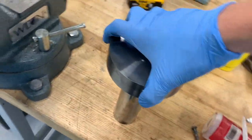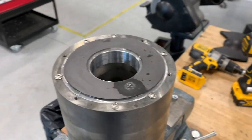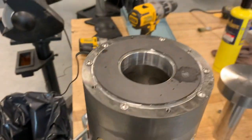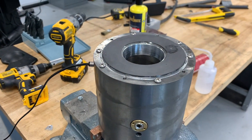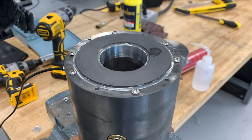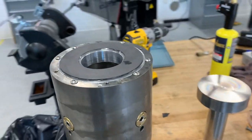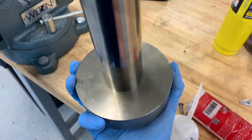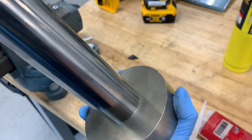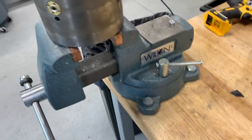Here's the shaft, and I'll put in a quick video actually kind of showing how this is assembled so you can see what the arrangement looks like, because this bearing is modular — it can be taken in and out, replaced, swapped out, all that. I'll grab the shaft here, and this shaft hasn't even been lapped yet — it's still just the turned surface. It's a good turned surface, but it's still just turned.